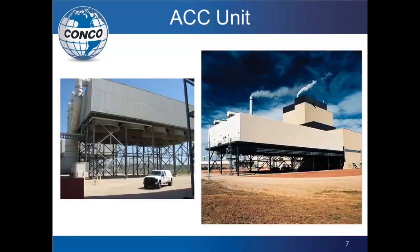Here are a couple pictures of the ACC unit. The one on the right is a smaller one with two steam headers at the top. I want to point out where it's sitting: there are graveled areas around the ACC unit, a road, dirt, brush, grass, and possibly some trees. All that debris area is susceptible to those fans pulling that air in and possibly pulling in that debris and blowing it up through the fins. ACC units also run into problems with wind shear — the direction and temperature of the wind affects the unit.